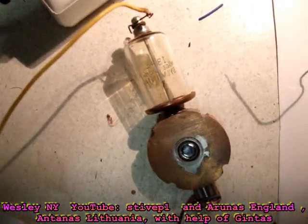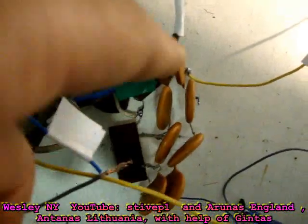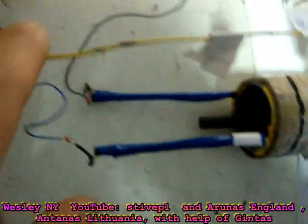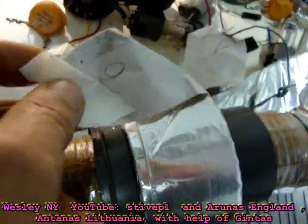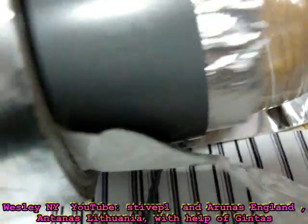Okay, the spark gap, this is the spark gap in here, it's not working over there. And the regular structure, which is two diodes and a capacitor connected to the one wire. Now this is a high voltage, just a high voltage in here. Now, this wire is the ground wire. This is the ground wire. And this is number two. So again, number two, ground wire connected to one side of the capacitor. Number two in here is then used as a connection to a small piece of foil that is put in here, through the spark gap, of course.